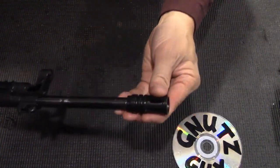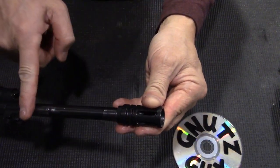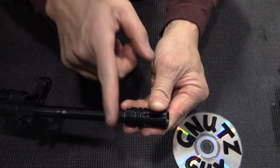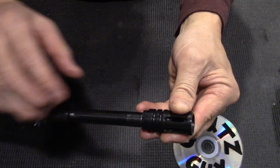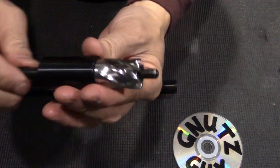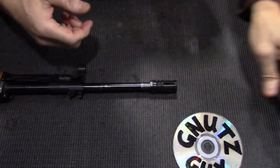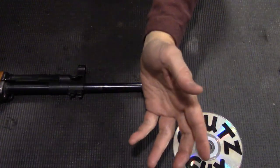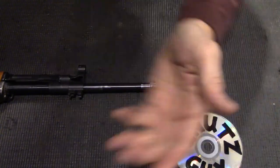I want to point out that I didn't reduce the full diameter — I left about five eighths of an inch. The reason is, should I ever want to put the grenade launcher back, it won't flop around. Also, this diameter matches the diameter here, which will allow me in the future to move the front sight block forward against the muzzle device to increase sight radius. Another tip: when using the cutter and holding the drill handle, move the handle around so you're putting even pressure all over and not just on one side. If after watching my videos you're not confident doing it yourself, that's fine — just take it to your gunsmith. Thank you for joining me and please subscribe.